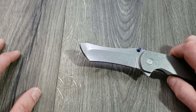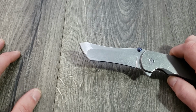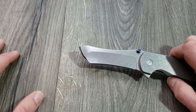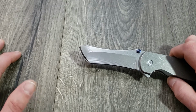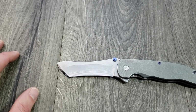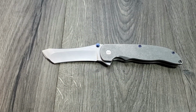And I know from the factory, Eric sharpens all the knives, I believe, or at least he used to. And they have a 2x72 blade grinder, and they split the belt, so it's actually a 1 inch by 72 inch. So it's the same. The Work Sharp with the blade grinder is a 1 inch by 18 inch belt, so same type of thing. But not very difficult to sharpen. At least in my eyes, it was not that bad. Not nearly as difficult as I expected.